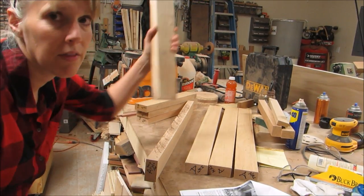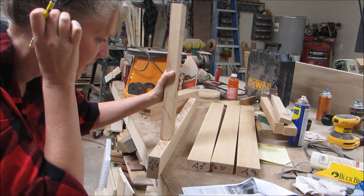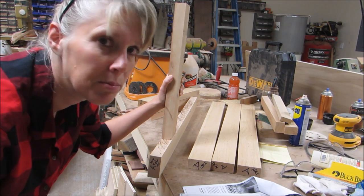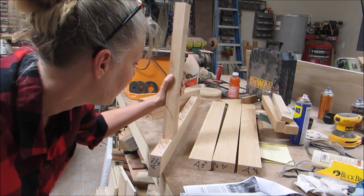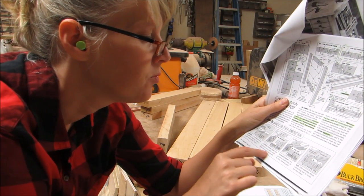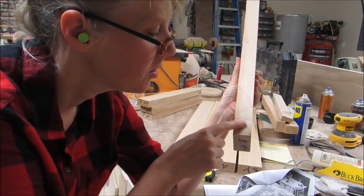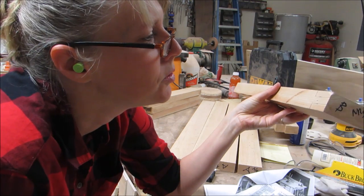What I figured out about the thickness is when this part gets mortised or tenoned, and this one gets mortised or tenoned — since this isn't easily divided by three because of halves, it's a little bit less. So it's just harder to figure out where half is in the center. But as long as I make sure that male section is a half inch in the middle, I should be good. The plans say to make overlapping passes with a dado blade to shape the tenons, and I've drawn out the dimensions they're supposed to be. I'm just going to go over to my non-dado blade on the table saw and see what I can do to make that cut.